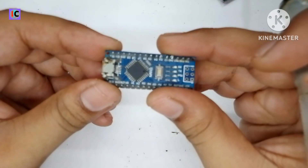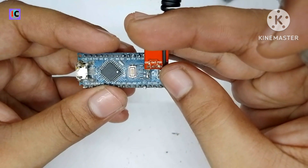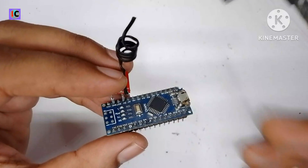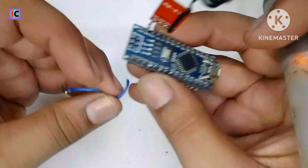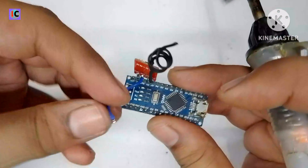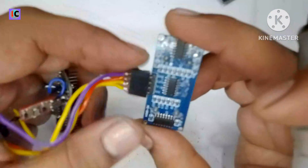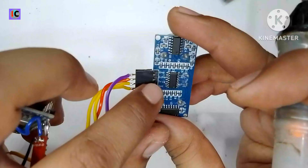The receiver is now complete. We just need to power the receiver section with a USB cable. Now we have to make the transmitter side. For the transmitter, I am using a 433 MHz transmitter module connected to the Arduino Nano's 5V VCC and ground respectively. The data pin of the transmitter module also connects to digital pin number 2, same as on the receiver side. In the code you can also change the data pin of the transmitter and receiver — for example, you can use digital pin 5 or any other GPIO.